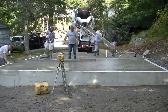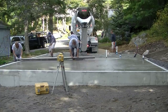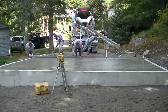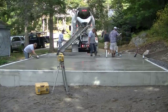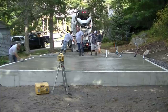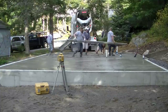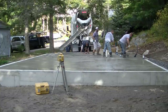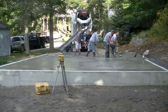That's the simplest way to screed. You could also run a two-by-four down the middle where that wet pad was, set it to grade, screed off that, and pull it out afterwards — if you're not confident enough to wet screed. We were taught to wet screed like we're doing here. You may not be able to go as fast as us, but just by trying it and going nice and slow, you should be able to get this down.